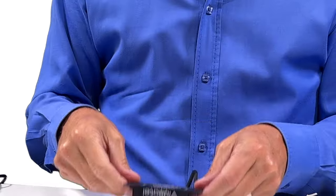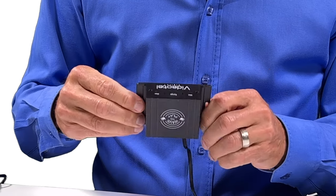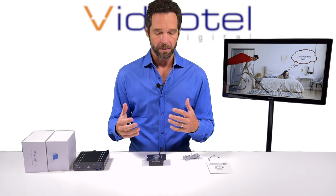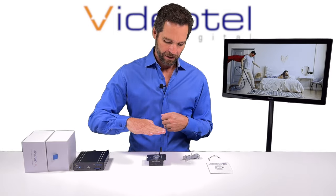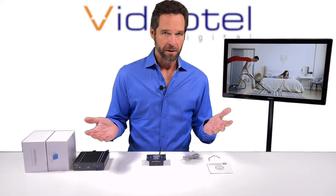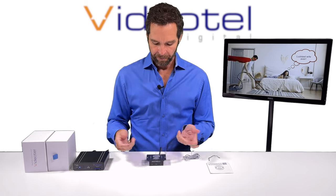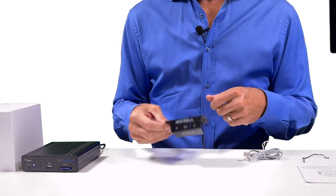The sensitivity on the front is pretty self-explanatory. As I adjust it right now, we're on minimum and the device just keeps triggering. I can press the button and you'll see it starts flashing — the range goes higher and higher. The device does recalibrate as it gets into new environments, so as I'm setting it on the counter it's recalibrating, which can take a little while. With a longer range it'll trigger from farther away — useful if you have a thicker material like a quarter-inch piece of plexiglass. If you set it low, they'd need to actually touch the counter. The adjustments are very simple — press the button for a second and it'll go to the next light.